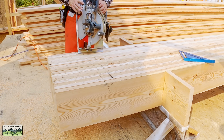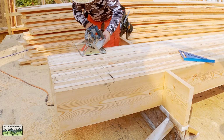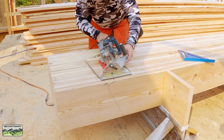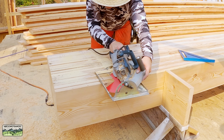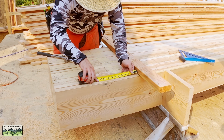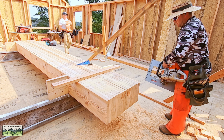Now I'm just gonna make the seat cut again. Remember it's like what, 63.5 degrees? But because I don't need the full depth, you notice that I backed the saw out just a little bit, and that actually does make it cut a little faster. The first half of that cut, of course, is sped up, but now you can see the process. It's okay that I overcut, that's all just scrap blocks. But you see what I mean about the depth. You don't need the full depth at that point. Once again, the guide is dead parallel to the cut I'm about to make. And here we go.